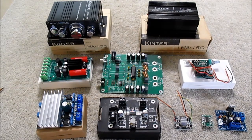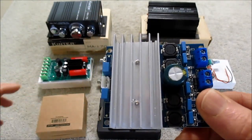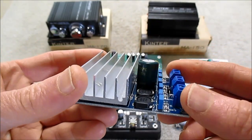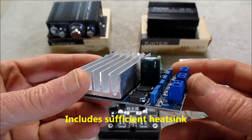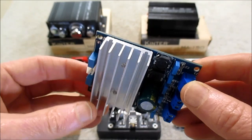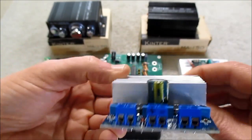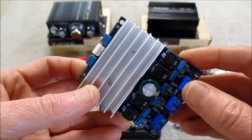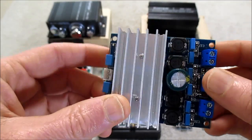The best of the Class D boards is the TDA-7492. It gives you decent output power and you can run it at higher voltages than the other ones I've tested for more power. Now they do kind of overrate these things — they rate them at like 10% distortion — but for actual clean power, this one delivered the most of all of them. I didn't notice any issues with distortion at low levels. It did have some background hiss, but it wasn't as severe as some of the others. This one is the best of the Class D boards.